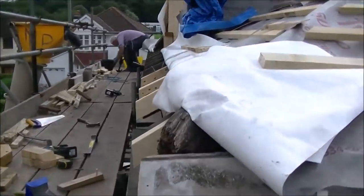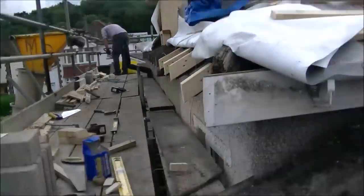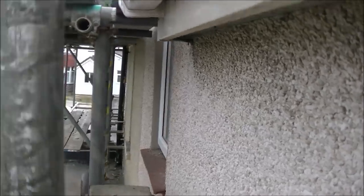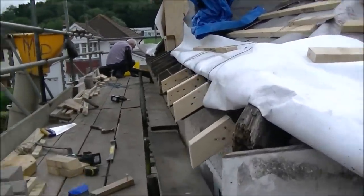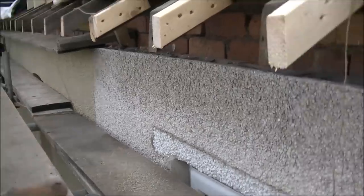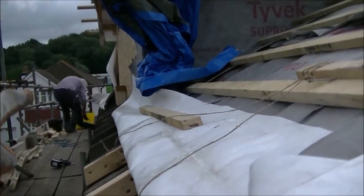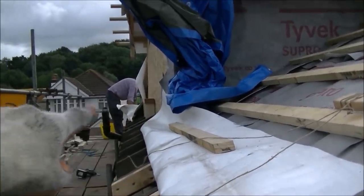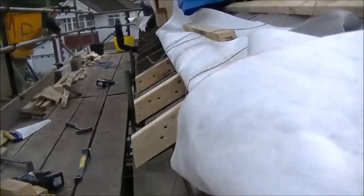We've done exactly the same on the side of the house. If you look at those rafters, they go lovely down in a straight line so we can put a nice straight fascia on. There is ever such a slight bow in the wall, and the roof had obviously moved as well over the years. The combination was a big bow, and when they put the other fascia in previously they'd joined it at an angle so it almost came out one way and back in at another. By extending a couple of these rafters and taking off a few in the middle, tapering down to nothing, with the last three rafters on the end being fine, we've now got a nice straight line equidistant out from the front cheek of the dormer all the way along. It should be much nicer fitting the fascias now.